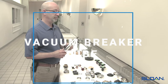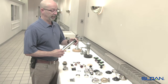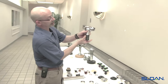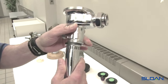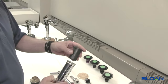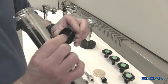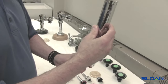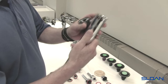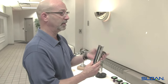The vacuum breaker tube — besides being flanged — has vent holes punched into the top of the tube. Inside is a vacuum breaker sack, which is a flexible sack. Once installed, the tube sits over it. During the flush, water expands the sack, and being that it's a tight fit, it seals itself to the inside of the holes during the flush. Water exits through the slit in the bottom, the sack expands, and water flows into the toilet or urinal. At the end of the flush, as the valve slowly closes off, the sack relaxes and air is drawn through as the siphon creates suction, finishing off the rest of the water and replenishing the water spot. This is required by code.